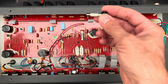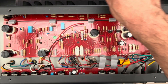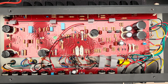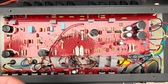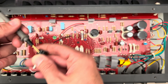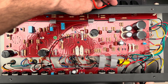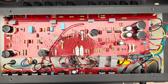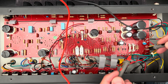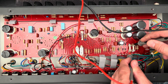Let's get the old trusty Agilent 34401A out and check continuity to see if this fuse has departed. It hasn't — that's the B-plus fuse. We've got several more on board that we're going to check out. I also see some 100-ohm resistors.